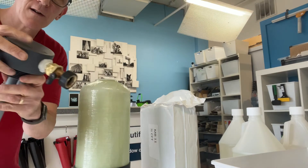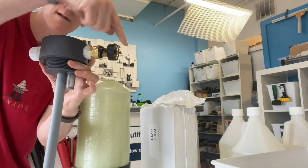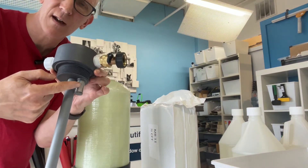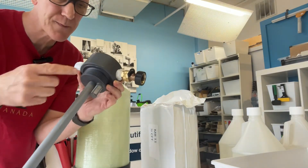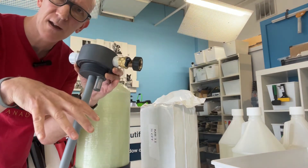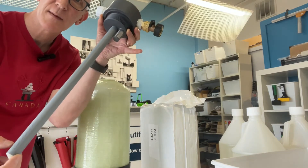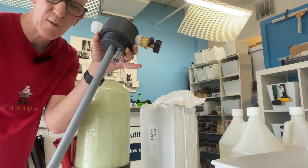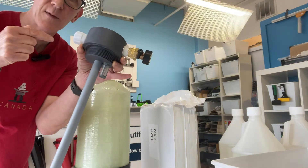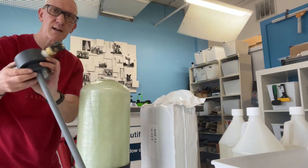Since I have this out here, I'm going to talk about how this actually works. Water comes through the input side where the ball valve is — there's a little strainer there to catch any debris. The water will go down and seep through the DI resin media. When it gets down to the bottom, there are slits in the bottom of this riser, so the purified water will then go through these slits, up through the riser, and then come through the output side. It's as simple as that.